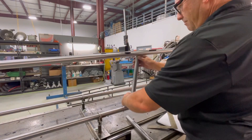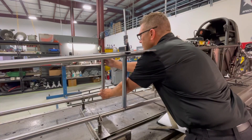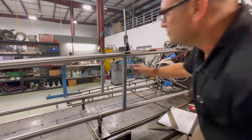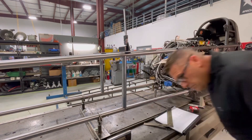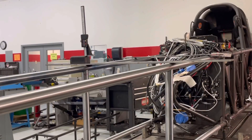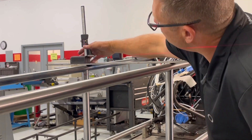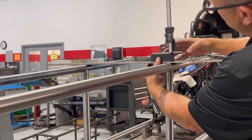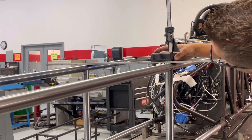You have to look at it like this: the lower rails are supporting the top rails. I built this thing like a bridge. The lower rail is very important — it is the basement to this whole structure and the way it's going to respond when you hit the gas. Also, when it's coming back down on deceleration, this lower rail is really important.